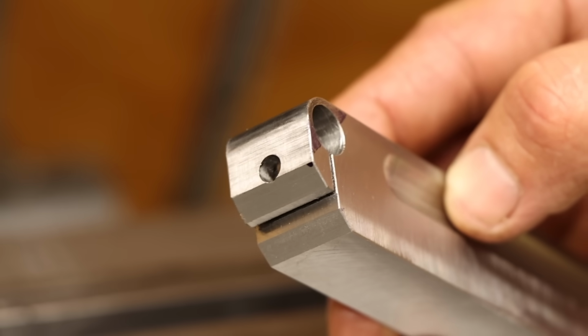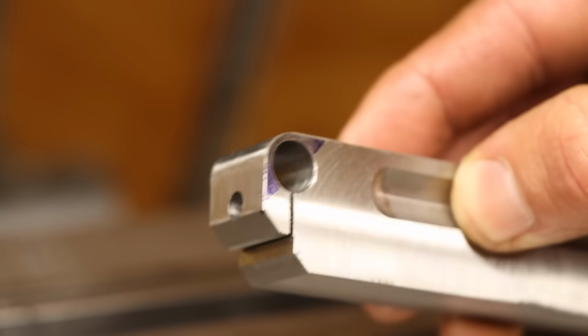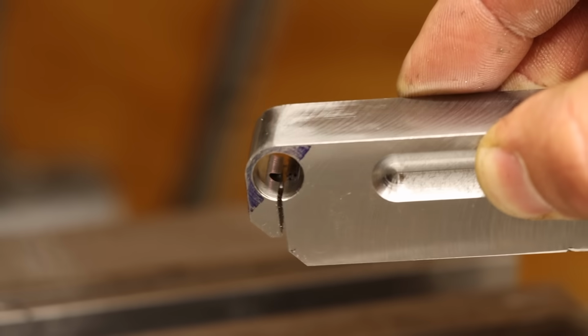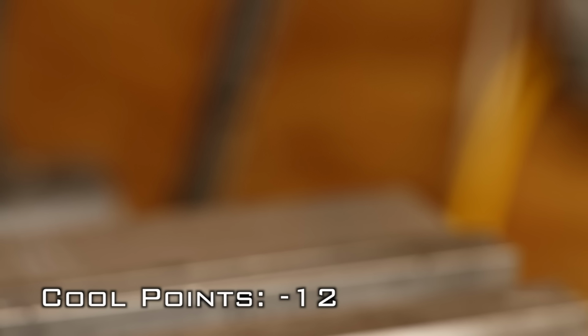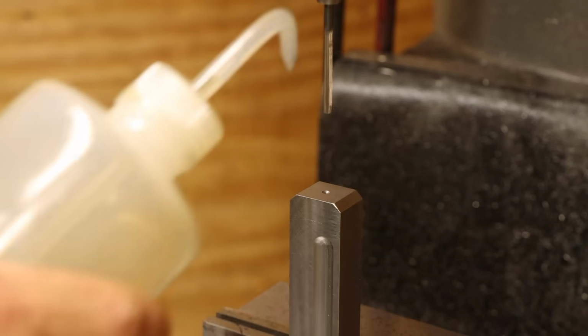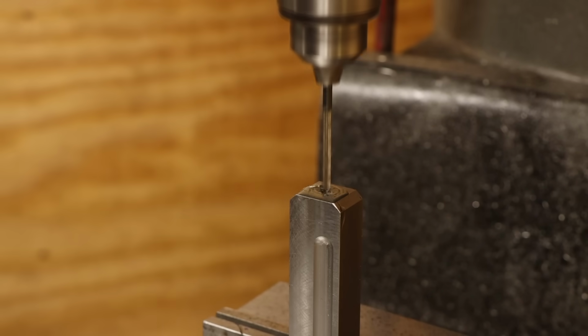I only just now discovered a huge error I made. The screw hole I just drilled in the end intersects with the indicator bore. Somehow I misjudged this clearance during the design. What a doofus. Looks like I'll be starting over. I'm pretty close to the end though, so I think I'll go ahead and finish this out just in case I discover any other hidden issues.